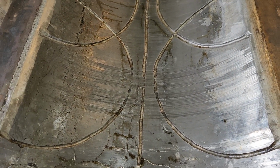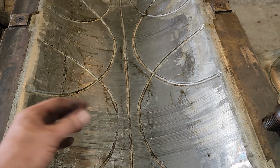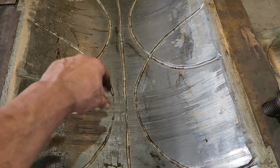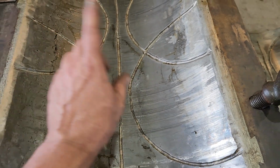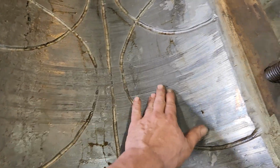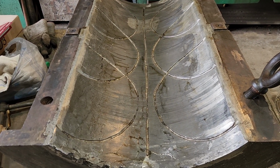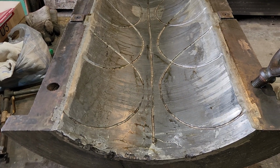This engine sat outside for a good number of years after we put it together here, and there were these two holes in the top of the bearing cap that you could look down in at the top of the shaft rotating, and there was also a place where oil would drip down. Well, the one at this location at the top of the shaft had quite a bit of corrosion that built up over the years, and so when we rotated the shaft, all that corrosion came down and right on through there, and it kind of mushed over the Babbitt into the oil grooves and messed up the surface a little bit. So we're going to get in here and kind of clean this up, polish it up, of course polish up the journal itself when this all goes back in. We are going to reuse these for now. I don't really have the resources to re-Babbitt these.